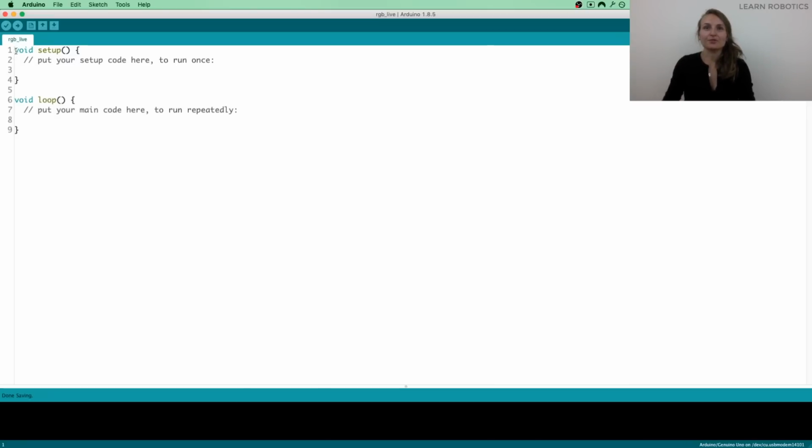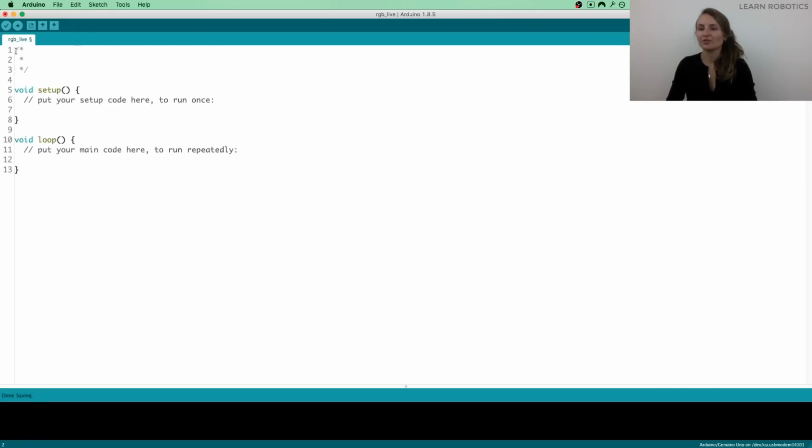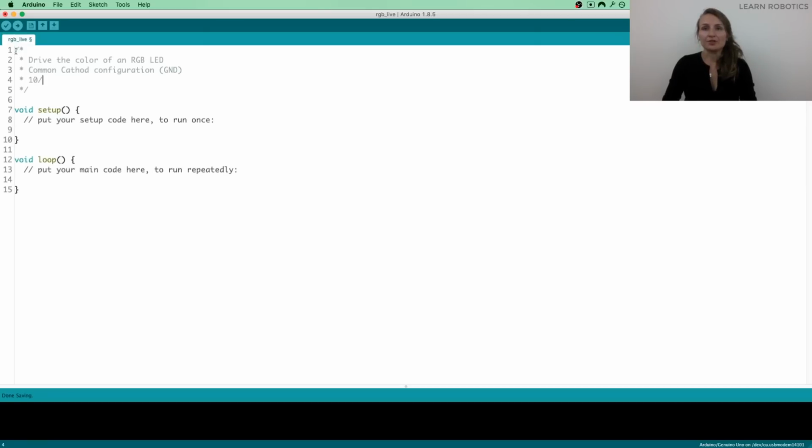So the first thing I like to do with my Arduino programs is I'll give them comments. I tend to teach people to over-comment at the beginning, especially if you don't really know what's going on. The comments are just like English. They're not going to be read by the controller, but it's just a good way for you to put a little mental note into the code so that in a few weeks, if you come back to this code, you know what it does and you can reference things easily. So this is just going to drive the color of an RGB LED, and we have it in the common cathode configuration, and that just means that the longer pin is connected to the ground. And I'm just going to put today's date and my name.